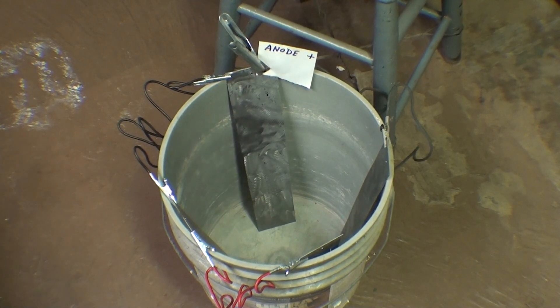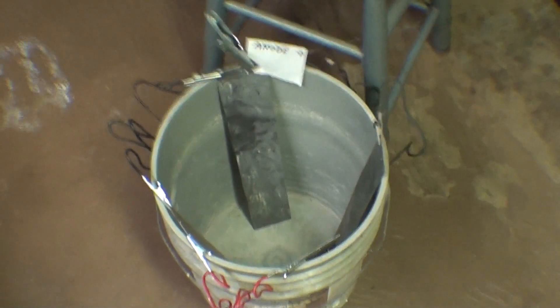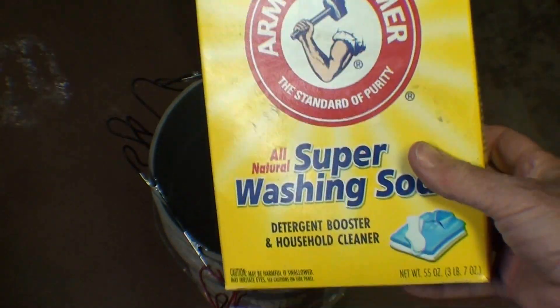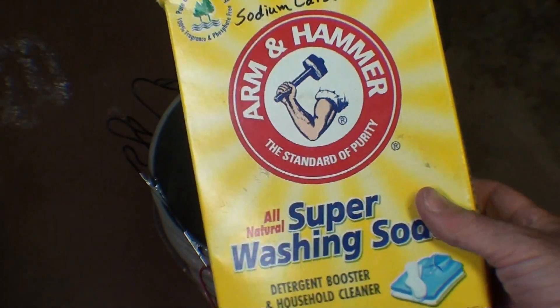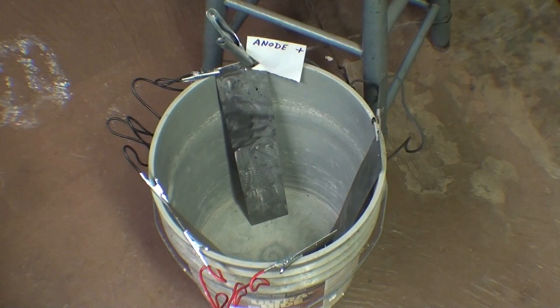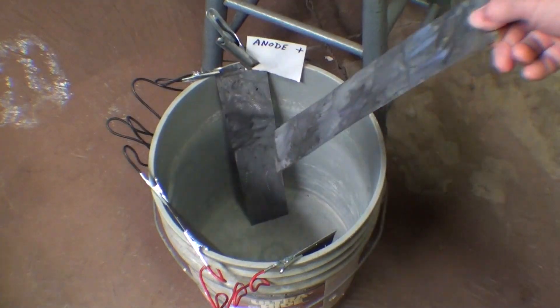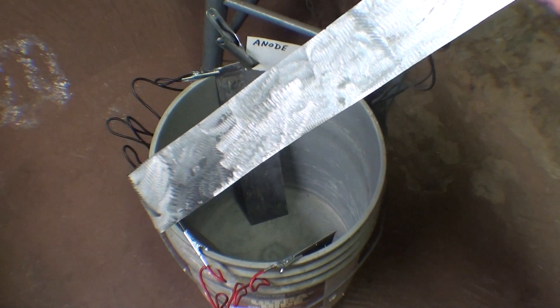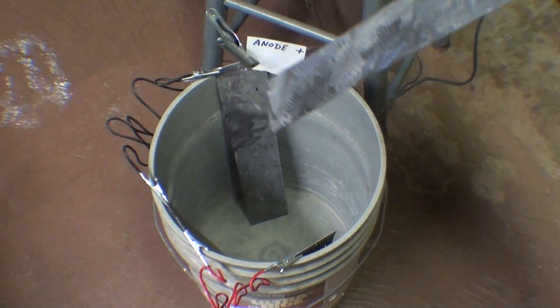You've seen me do this over and over. There's a five-gallon plastic bucket - don't use metal - and I'm going to fill that with water and then with Arm & Hammer washing soda. Don't use baking soda. I've still got people saying you can use baking soda, but just go buy the washing soda for crying out loud - it's two bucks. You need about a cup of it; it's very uncritical. In this bucket I have four pieces of sheet metal, because that's what I happen to have. There was paint on it so I had to grind the paint off. You can get by with one, but I'm using four.